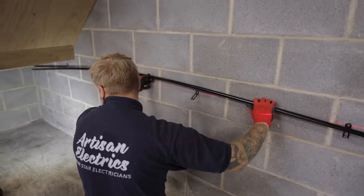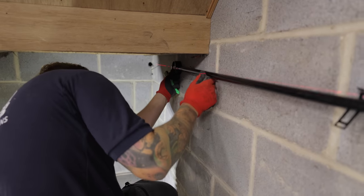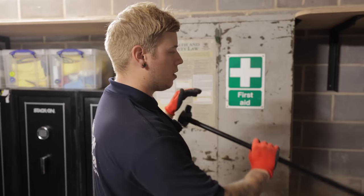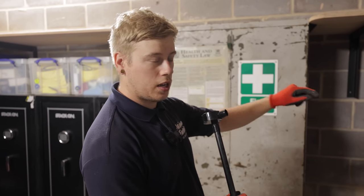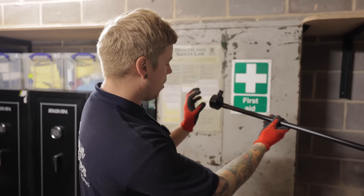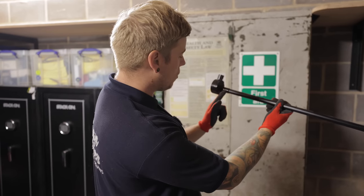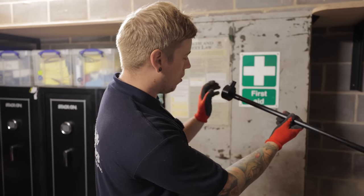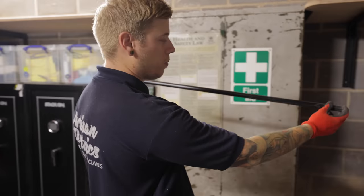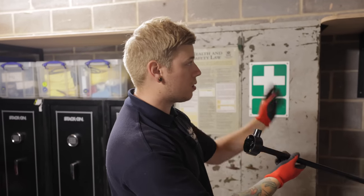Where I've drilled through I've drilled a hole bigger than 20mm so this will slide through. Because it's in the corner, I've drilled a hole far to the left-hand side of this stop-end box and put a bush coupler there. I pushed the tube through first, connected it to the other side, put a pencil mark flush with the wall, pulled it back out, then held the stop-end box at that flush line and taken it back down to where the tube needs to be cut. When I push that through it's going to sit flush to the wall, join up with my stop-end box on the other side, and the cables are protected through the wall as they come straight into the box - all one piece.